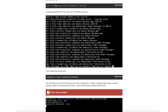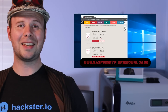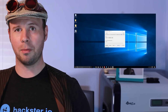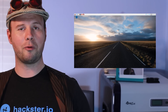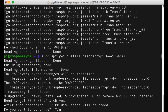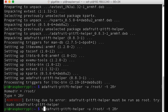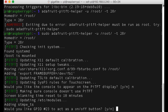Unfortunately that didn't really work for me and I ended up having to install it myself. So I used the steps to download the Raspberry Pi operating system, put it in the Raspberry Pi, boot it up, and set it up for remote access. Then I used the steps from the Adafruit website to download a new kernel for the Raspberry Pi to make the LCD work. I chose not to set it as a console display and I also chose not to enable the button feature.